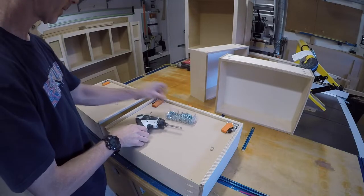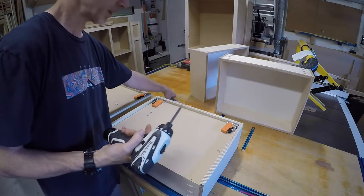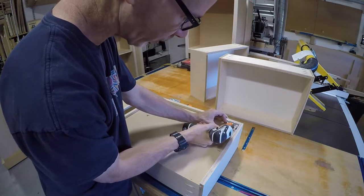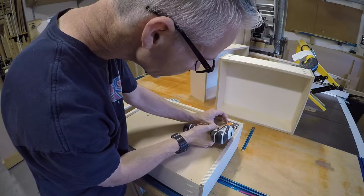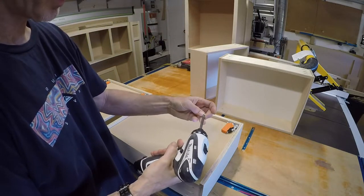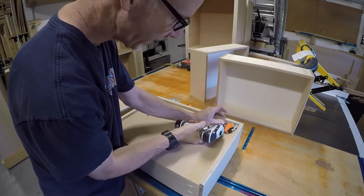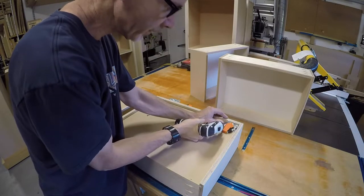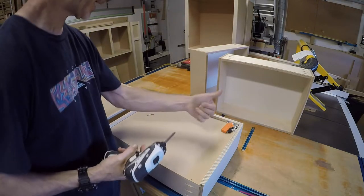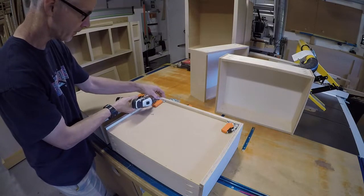These are 5/8 screws. These are self-drilling tips. You do not have to pre-drill, but depending on the material, you might want to. When you're drilling into this, you want to make sure that you're pushing down and have the drill bit at a little bit of an angle. And you don't want this thing flying up in the air. Sometimes it'll happen, but...